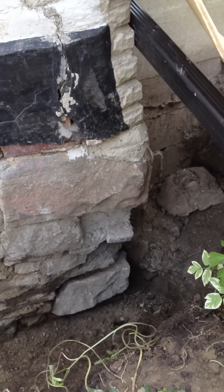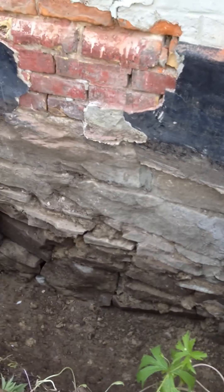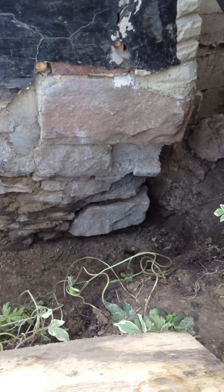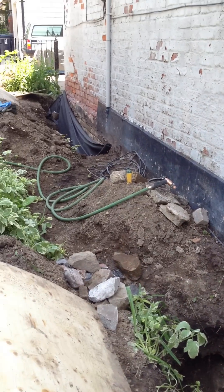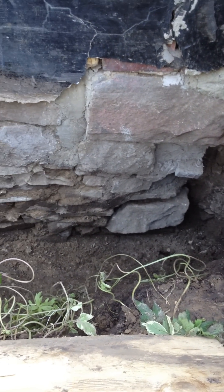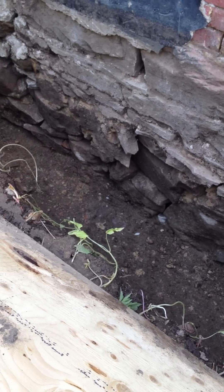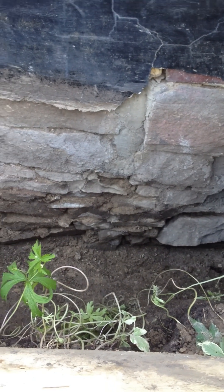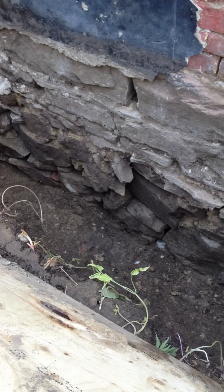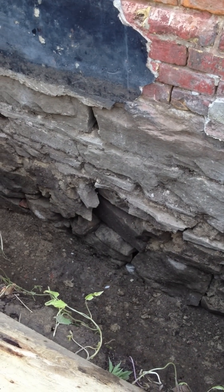The problem is that this was my first time ever going into a foundation wall made up of fieldstone, and I didn't really know what I was getting into. Nobody should touch a shovel until they're ready to get serious about the work, research it, and make sure they're safe. I discovered there is no footing on this house, which is apparently very common on older Toronto houses. They just laid the fieldstones down and used lime mortar to pack it in, then built right on top. Having dug some of the stones out, I felt it was worth putting them back and repairing the mortar.